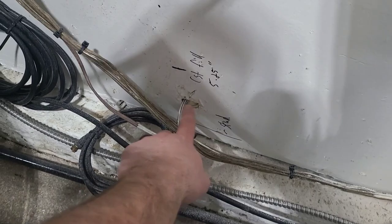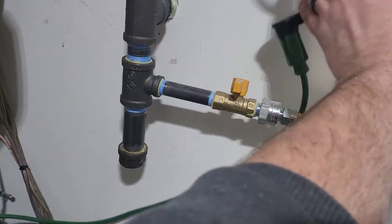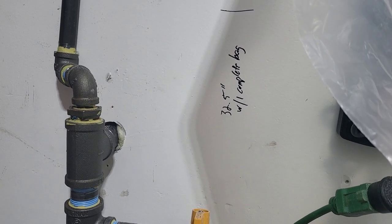We definitely got something — I don't know if that was from yesterday — but if the thermal shows anything, that's obviously air that was escaping. It's definitely warm there. I think we're going to break this up into two parts. Was it a success? Yes. But some foam did come out outside. With the first bag of post foam, some did come out. So where do we come out of this: yes, it works. Don't use a whole bag — definitely break it up. With one bag spread across that cavity, we went 32 and a half inches, and one bag costs $15-16 bucks.